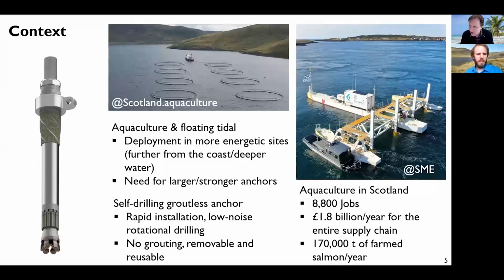Interfaces, what are the conditions at the interfaces? I guess the Hoek-Brown model is applied at the interfaces as well? Or I just used a Mohr-Coulomb one for this. Okay, Mohr-Coulomb, with a certain friction angle, yeah. And indeed, the interface properties are quite important as well. You can have some changes in the depth at which you reach this deep failure mechanism, depending on the interface properties. Sure.